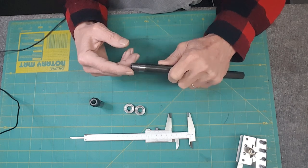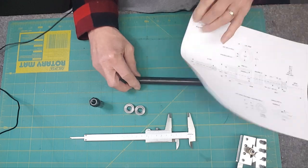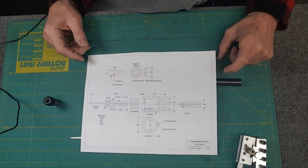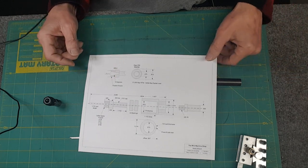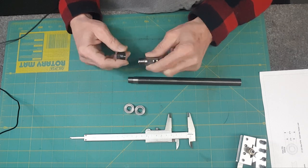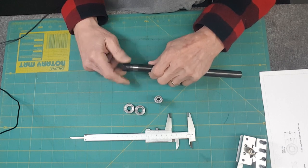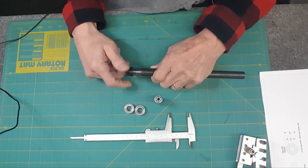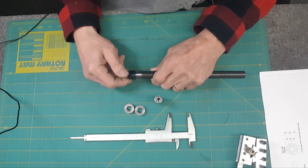Now I need to set it up in the other lathe to angle the compound per the print. The print calls for 18 degrees, but that's measuring across both sides — you have to cut it in half. Once I set it to 9 degrees, it sits nicely. I tested the collet in there and it sits at the right angle — perfect. It was way off at 18 degrees, I'll tell you that. The dimensions are, like, perfect on it — the collet goes all the way on, bottoms out, fits right inside. There's not much play in it at all, which I want to help seat the collet correctly.